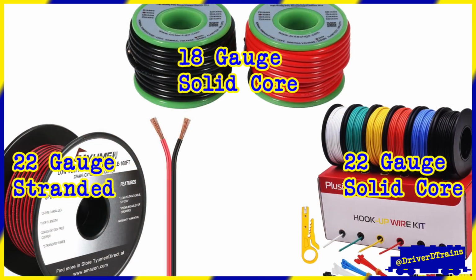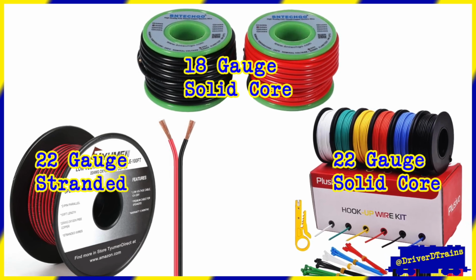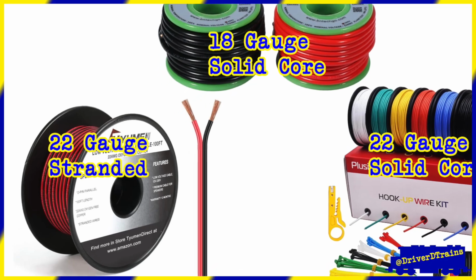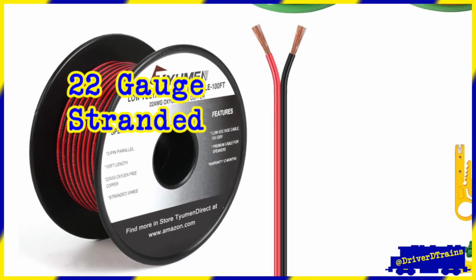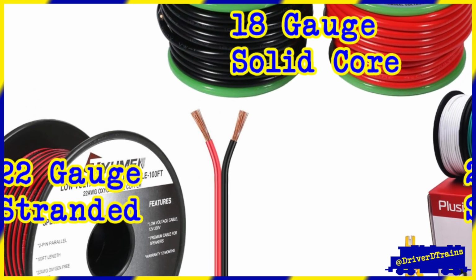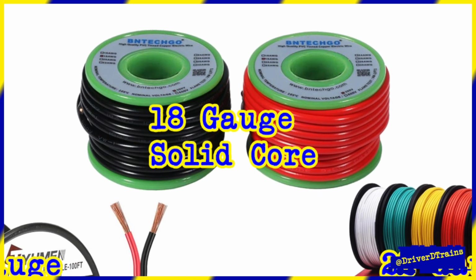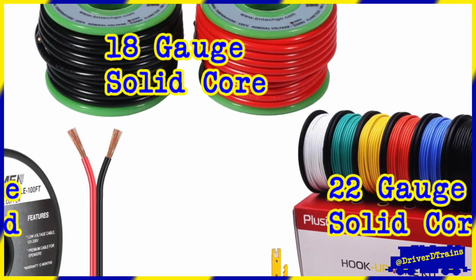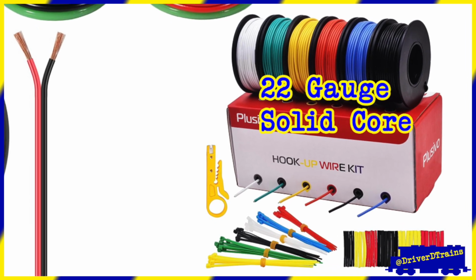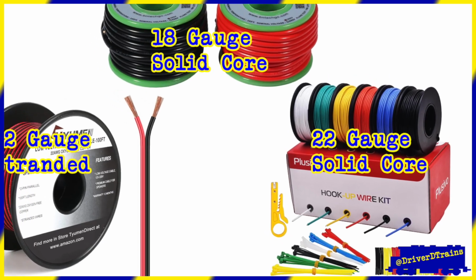It's also important to be aware that the overall diameter of solid core wire and stranded wire of the same wire gauge is different. I originally started with 22 gauge stranded speaker wire, but when I switched to solid core, I used 18 gauge wire, which was the same overall diameter. When I add additional power drops to the D-Saver in the future, I will use 22 gauge solid core wire, which is much thinner than what I used here, but still more than enough for such a small layout.